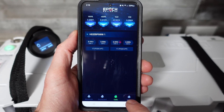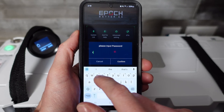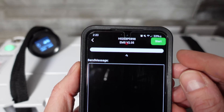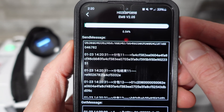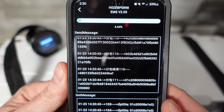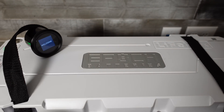To initiate the update, go to the About tab, find the OTA button in the top right, and tap and hold until you get a password prompt. The password is 'test', all lowercase — T-E-S-T. It'll prompt with firmware selections. We need to run the EMS update first and then the BMS update. Click the green Start button once, and it begins downloading. On the phone and on the remote display we can see it showing 2%. It takes about 5 minutes, and once complete the battery restarts on its own.